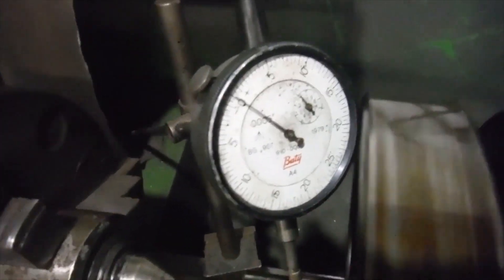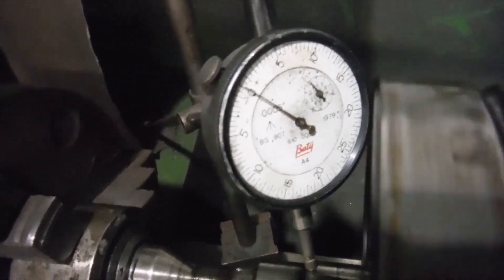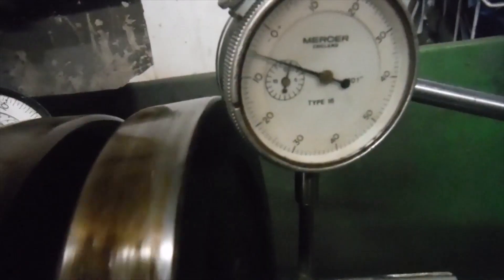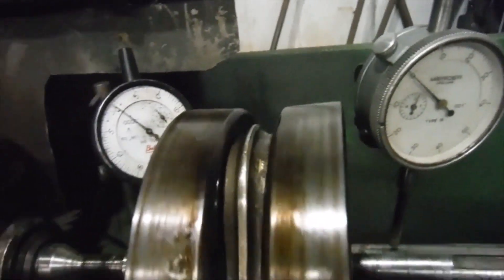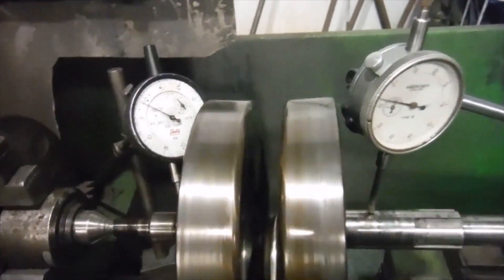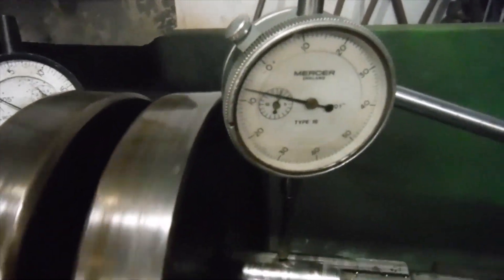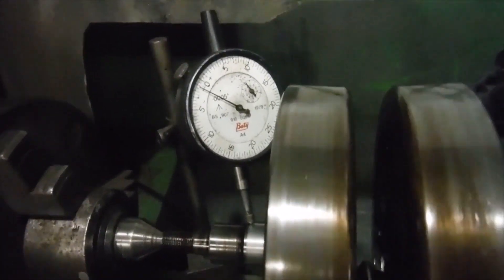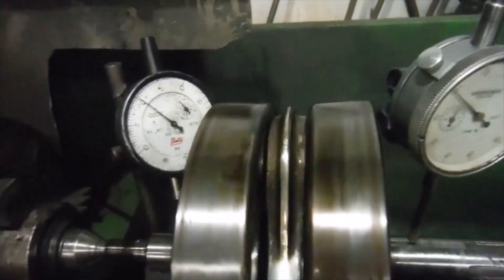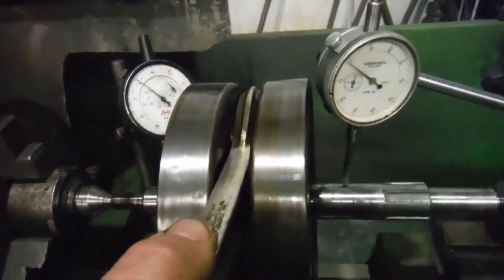On the timing side I'm seeing one and a half thousandths of an inch; on the drive side I'm seeing seven thousandths of an inch, and the needles are rising and falling at the same points of rotation. So I can largely subtract one from the other to give the true runout. Seven thousandths of an inch does seem a bit excessive, but I can take one and a half thousandths from that, which brings it down to five and a half thousandths of an inch — something I'd still like to think I can do much better than.